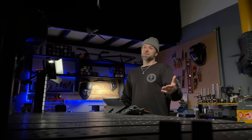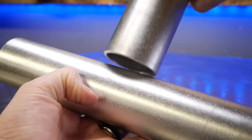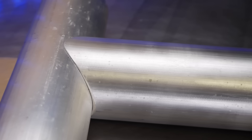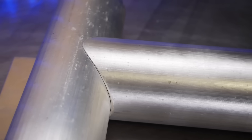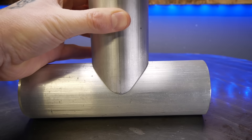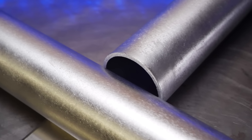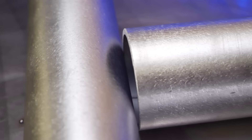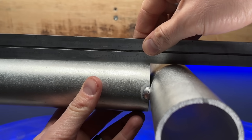But sometimes we just have to get things done in a hurry. And because of lack of tooling you might have on hand, or you're just lazy, you've made the decision to just fill it up and go. When you have a coped joint, it's going to be much more secure and much less prone to distortion and moving around during weldment. When we're dealing with a gap like this one, it's going to walk all over the place as you're welding — shifting and distorting — and it's going to be hard to keep it locked in at 90 degrees.